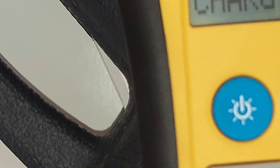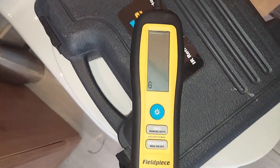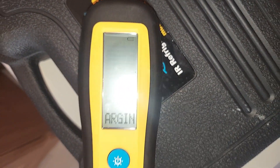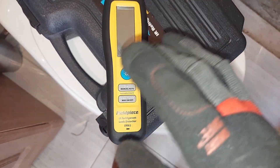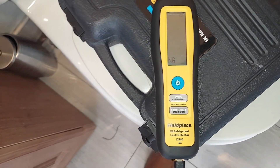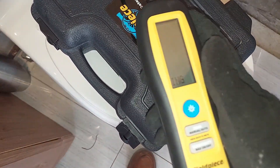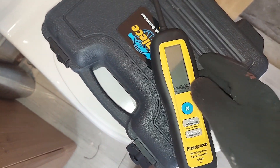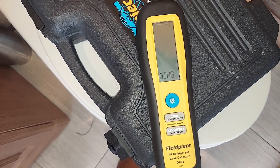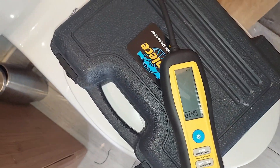Give this a thumbs up if you like it. Once this unit reaches about 50% charge I'm going to stop charging because I don't use this regularly - I want to keep it stored at around 50% all the time. That's the best way to keep these batteries. Don't leave it fully charged all the time - it'll ruin the battery. Leave it empty is also a problem. Leave it in the middle - that's perfect. I'm out of here.